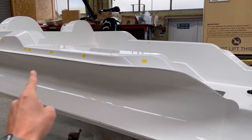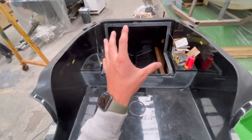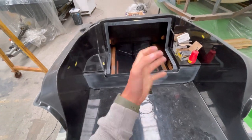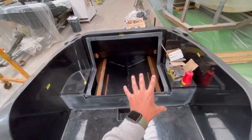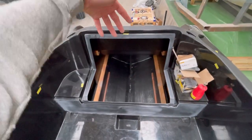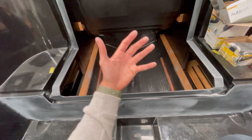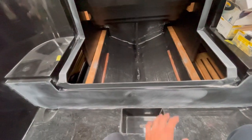I'm inside a Prime 941 which has come out of these molds. When I say globally strong, I mean every shape on the Ribeye complements other shapes to create strength in its entirety. You may often see back benches like this made from a secondary molding and bolted to the deck, whereas the Ribeye approach is always to create these using the main solid structures of either the hull or the deck. This is all part of the deck molding — it gives you more strength, and also when you open this back seat on gas rams it gives you a very large aperture for accessing the space inside the hull, giving you a class-leading storage locker. You can get wakeboards and loads of kit in here.